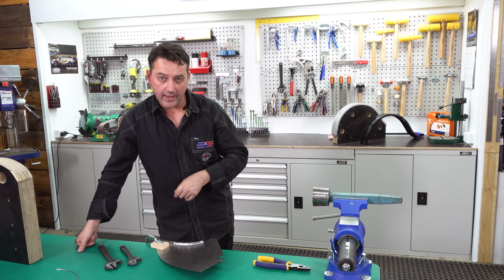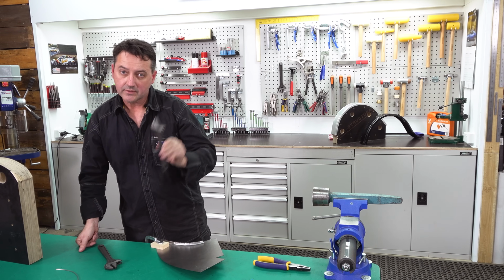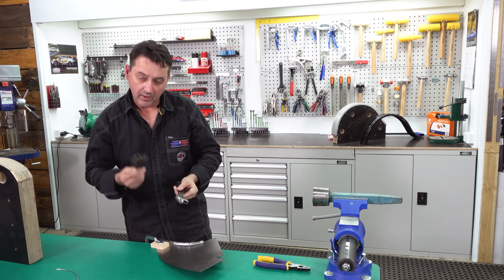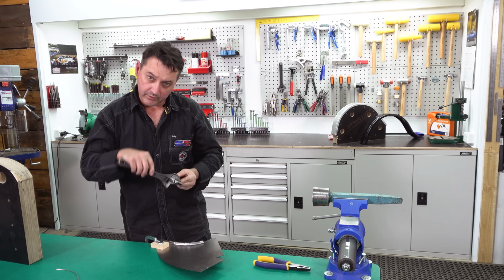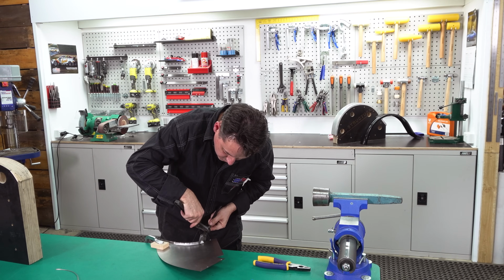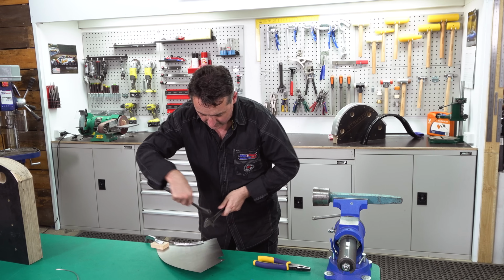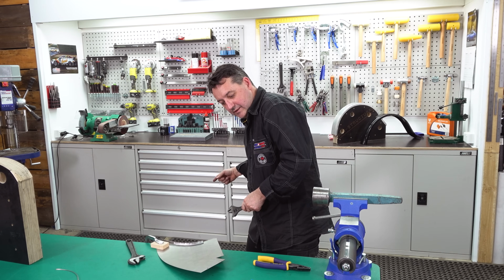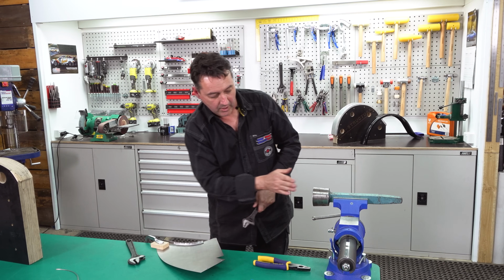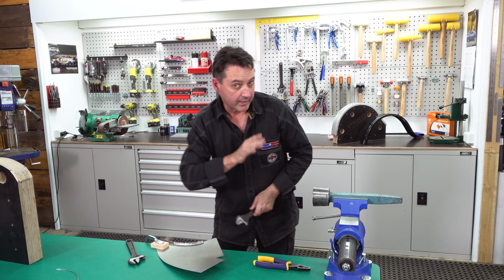If you don't have a shrinker and stretcher machine, then we can use hand tools. Simple shifter, a larger shifter to give you a little bit of leverage, and what we do is insert the jaw, then make sure that when you twist it, the peak of the metal is facing this way, because later on we'll be going over here using some of this round bar to then planish and smooth out.